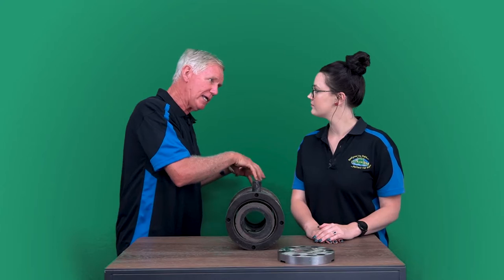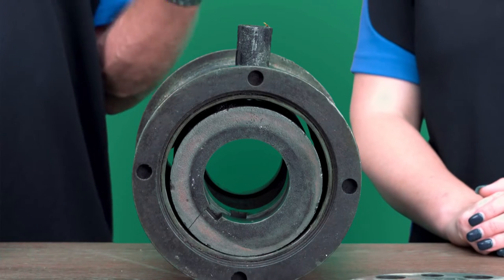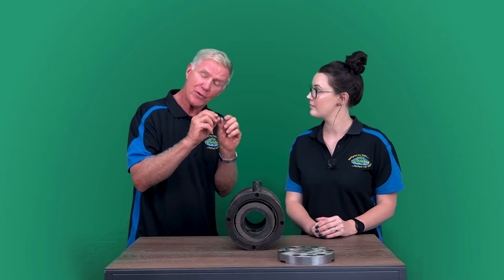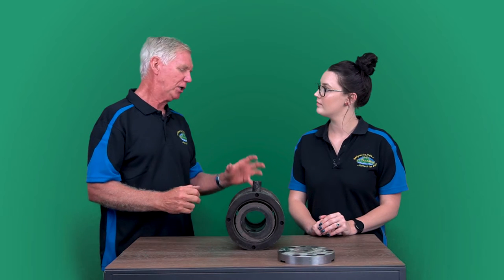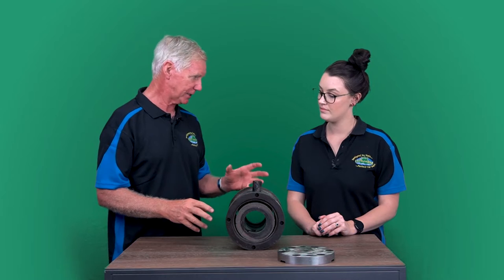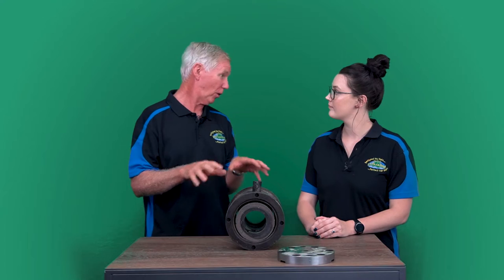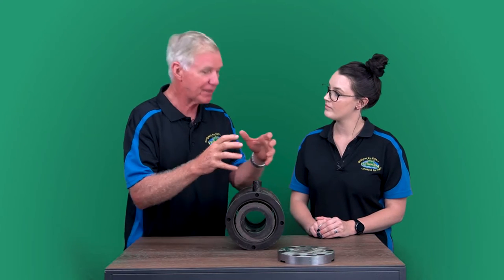The food going in back here has to pass along the flight and through that little gap. As it goes through that gap, there's a massive amount of shear force applied — shearing of all the particles within the powder. The individual plant cells, because we use primarily natural grains in our feeds, are actually torn apart in this process. With this particular chamber and setup, you're looking at approximately a thousand kilos of material being forced through that gap in an hour. To do that requires a massive amount of energy, and it's that energy applied within here that is the cooking process.